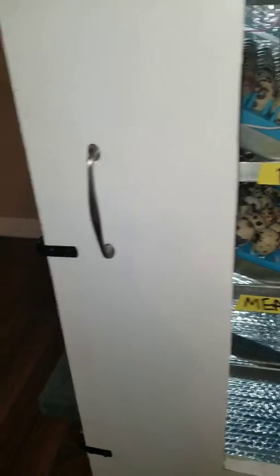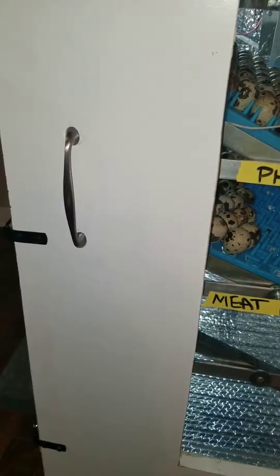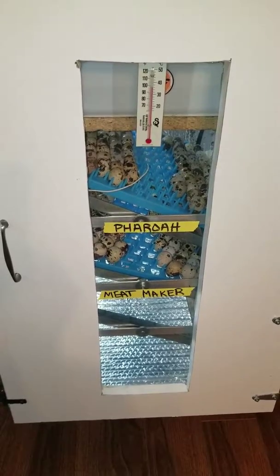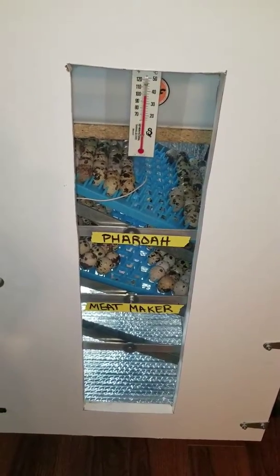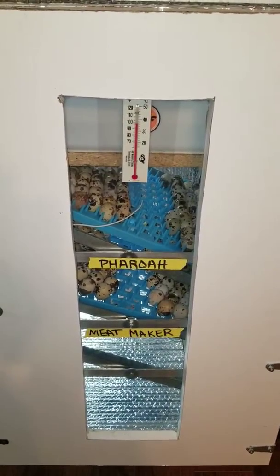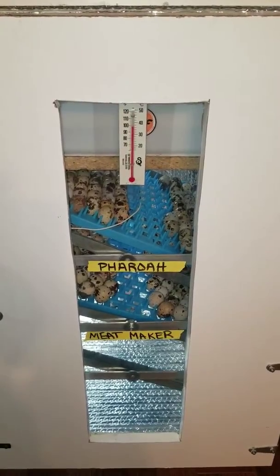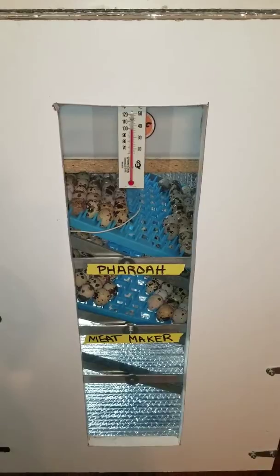I did get these GQF clips for the incubator — I had to order them — and the handle to open it was like 50 cents. The hinges I modified — had to bend them. It didn't come with a door, so this is melamine that I bought and cut out. Me and my neighbor cut it using his table saw and saw horses. He also gave me the glass. I put weatherproof, mildew-proof silicone under it, put weight on it to squeeze it out, and then brushed around it with a seam silver brush.